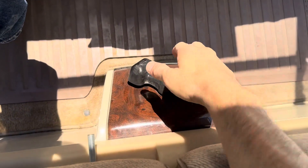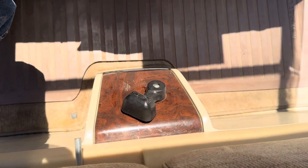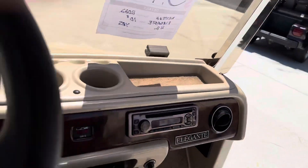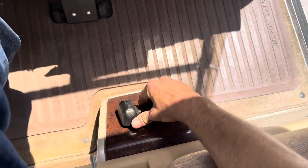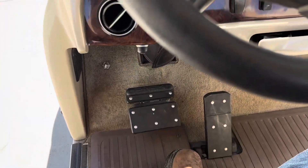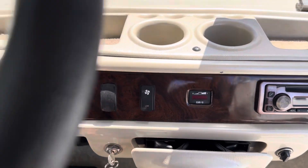Flipping into reverse all the way up — you'll hear the backup buzzer. Neutral: push the top part of the brake until it clicks and that'll lock your brake, then as usual turn the key switch off.